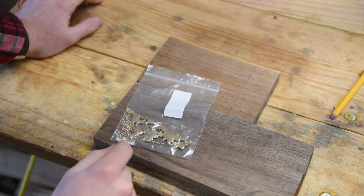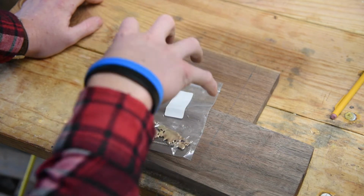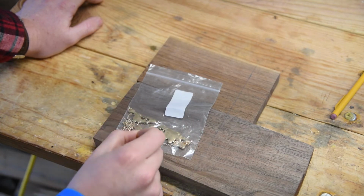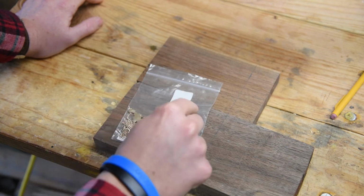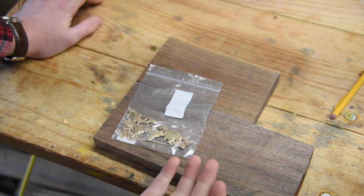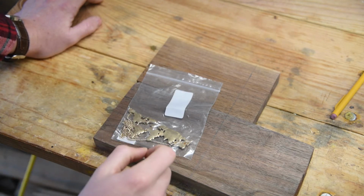What I'm gonna do is, whatever's the bottom, I'm gonna cut a little rabbet around the whole thing that the lid will fit over. And then I'll hollow out the inside for this to fit down in there. And then just carve out the lid a little bit so that it fits down over the bottom. And then we'll sand it and finish it and be done. Should be just maybe a couple hour project. Gonna use the router, my little trim router, for a lot of it.